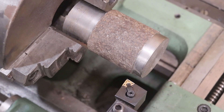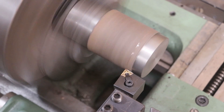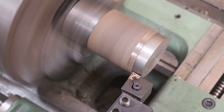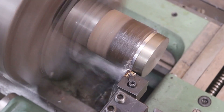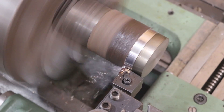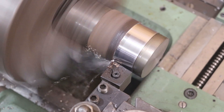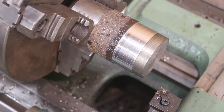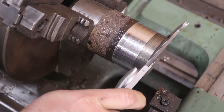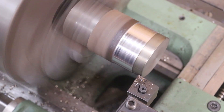Just some mystery metal here — I went over to my scrap pile and found whatever I had laying around. I'm going to come in first and just clean up a surface to work off of. I only need to peel back about an inch and a half, two inches — that's plenty. Let me grab some calipers and get a quick measurement. The largest one I need to make is two inches in diameter, and we're already starting out at over two and a half inches, so I've got a little bit of material to cut off.